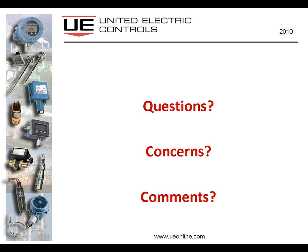This is Chris. I had a question. You'd mentioned on your last slide a nuisance filter or a nuisance trip filter. Yes. So that's built. Is that built into it? And if so, how long of a delay is that you can have on it? Yes, it is built in, and it's deactivated when we ship the product. But it's simply a couple of keystrokes to turn it on, and you can set the time constant. You have 4 choices. It's a quarter, a half, 1, and 2 seconds. Okay, so great. You're basically setting up that adjustable window of time using that.